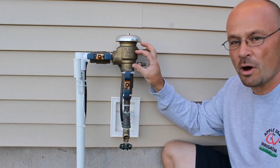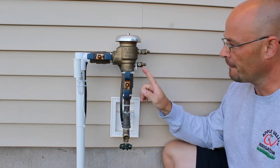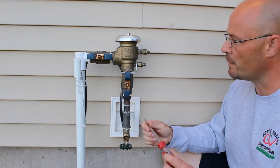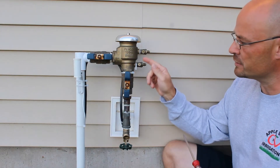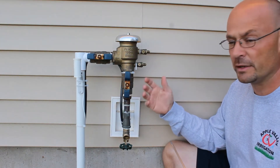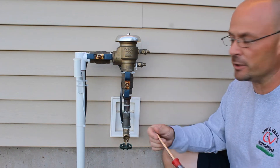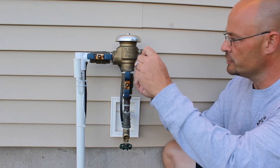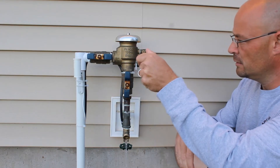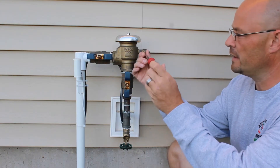There's still sealed water trapped in a couple of chambers up inside the backflow preventer. On the side of this particular model there are two bleeder valves. There's a little set screw — a captive screw — meaning that you can turn it a thousand times and it's never coming out. It's not threaded; it's actually a handle. With the slot perpendicular it's closed. You want to take a screwdriver and turn the slot parallel to the fitting, and that opens it.